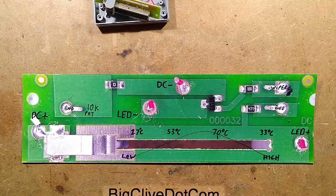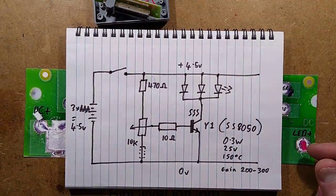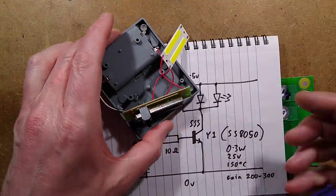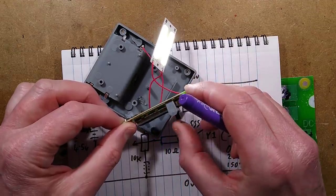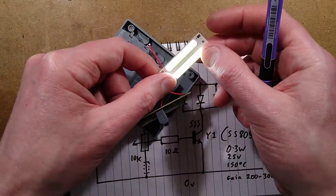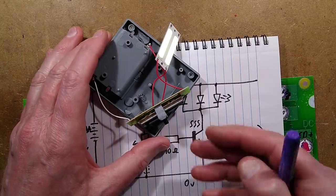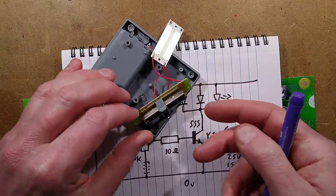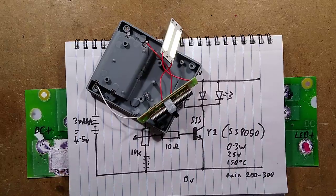It's a very simple, straightforward circuit - could be useful as a reference if you wanted to build something similar yourself. It's not bad; it works. The transistor doesn't get dangerously hot - it gets pretty hot but not too hot. It has a good brightness range. I would have liked to see an extra resistor in series with the LEDs to cap the maximum intensity, protect the LEDs, increase battery lifespan, and protect the transistor from getting too hot. But it's an interesting and helpful little circuit.